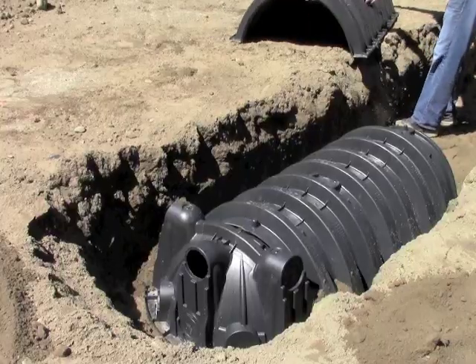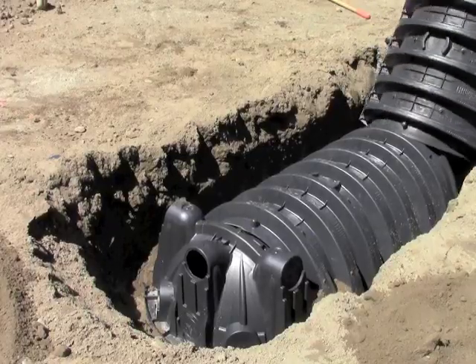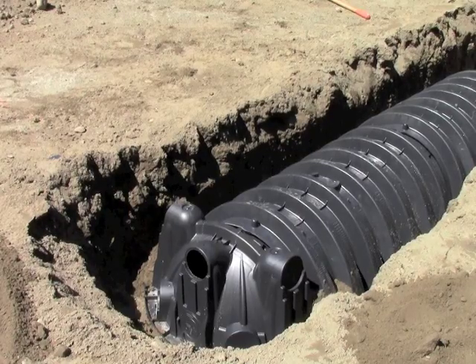When the chamber end is placed between the connector hook and locking pin at a 45-degree angle, the pin will be visible from the back side of the chamber. The connector hook serves as a guide to ensure proper connection and does not add structural integrity to the chamber joint. Broken hooks will not affect the structure nor void the warranty.